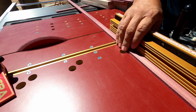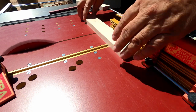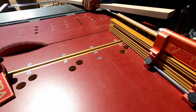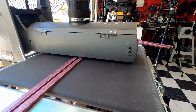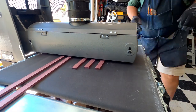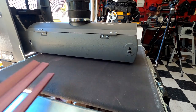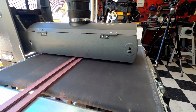Now I'm working with the purple heart, cutting that to length as well. I cut them to about the same distance as all my maple pieces so they match up fairly well. The purple heart was ripped to just a tiny bit over a quarter inch wide because I need to flatten both sides on the drum sander. All my quarter-inch purple heart pieces were cut about a sixteenth inch over so I could bring them to the sander and get rid of all the burn marks - it's a relatively hard wood and it's really difficult not to get saw marks or burn marks. The sander flattens everything to the same size, which is important so that when the trim pieces meet at the corners, everything matches.